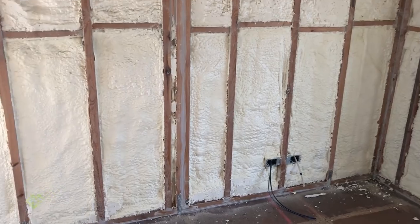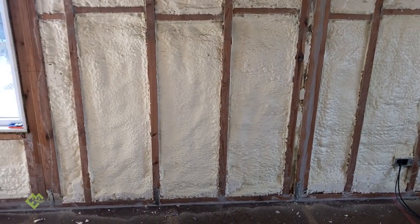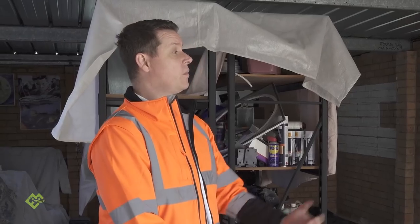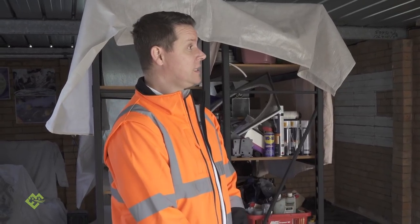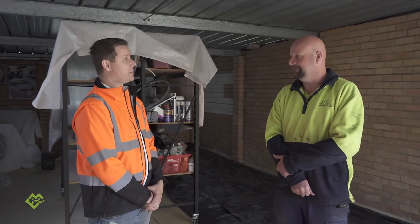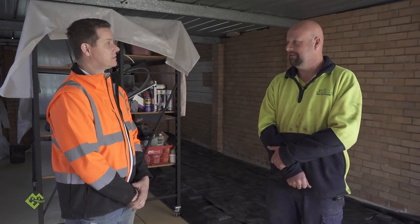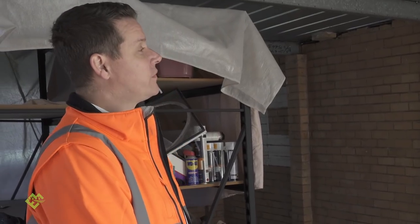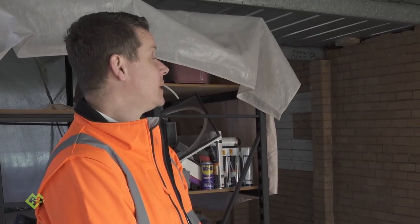People say that the walls are plastered, but you still have downlights, you still have holes, manhole covers and things like that where that fibre can come down and you're breathing it. You can even get ducted heating systems that are not very well sealed. I see it every day when I'm spraying floors — I get under crawl spaces and you see that the ductwork is broken down and just inefficient. You're just sucking air from up in the roof and putting it straight through your house, where you've got condensation forming and black mould. So there are quite a few benefits.